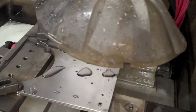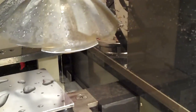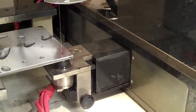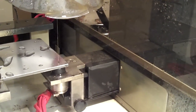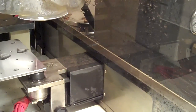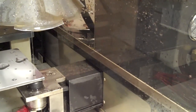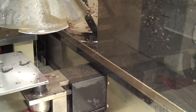I'm going to turn the machine off and run the hole center routine. The wire is going to move forward and touch one side of the hole — it touches off six times — then come back and go off to the adjacent side of the hole and do the same thing. Then it will come 180 degrees over and pick up the third point of the hole. From those coordinates it will determine the hole center, and the program will be ready to start. So now I'm in the center of the hole, the machine knows where it is, and we can start running the program.